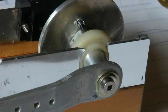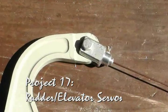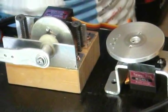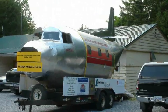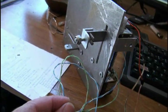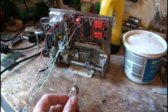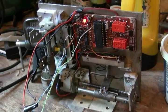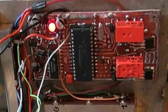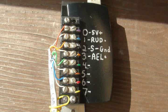Dobie, the project manager, wanted moving elevators and a rudder on the plane, so I reinforced a pair of servos to control them. They have lots of pull, but not enough to handle the pull of wind and transport. The rudder was connected with an arm and stainless rod that bent and twisted under the force — too bad. It's little wonder, as the rudder is 6 feet tall and the elevators are 4 feet each. So immediately I set off building a much more rugged linear drive set. These are rugged with a solid bar attached which won't bend under the stretch. The motor board is heavily constructed, so while motors may be overcome by strong winds, the mechanism won't be damaged at all. The connection box allows the whole thing to be disconnected with a single plug when the tail is removed for transport.